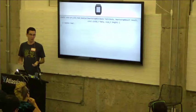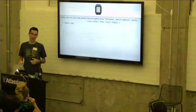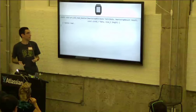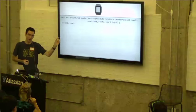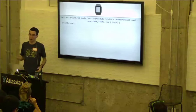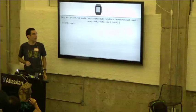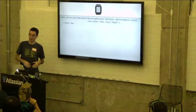Now on the watch, one of those handlers that we subscribed was a did read handler. And that's going to get called when we actually get that response back from the Smartstrap or when a timeout occurs. So you can see here the parameters are the attribute that we actually made the request on. In this case, that would be color adder, that variable that I created. We're going to get the results, which would either be Smartstrap result OK or possibly Smartstrap result timeout if we never heard back within a certain amount of time. And we're going to get the data and the number of bytes that we actually got back from the Smartstrap.